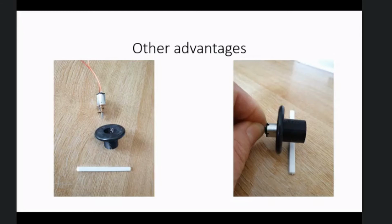Now I had a quick look at the UKMARS bot PCB, and it wasn't entirely clear to me that the space where the motors are attached couldn't be freed up to move the wheels in on a next revision of the PCB. I think that between the front and the back of the mouse, all there was connectivity. So I may be wrong. The encoder wheels are what stop the motors going more inboard than they are. Now, I would want to leave the motors exactly where they are and just move the point of contact of the wheels inboard. Oh, I see. Yeah. Right? Okay.